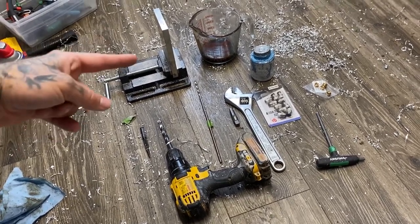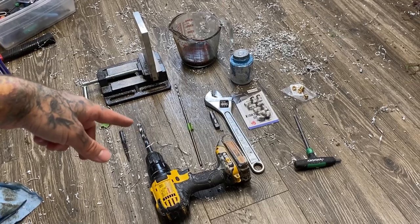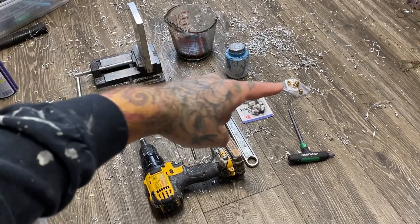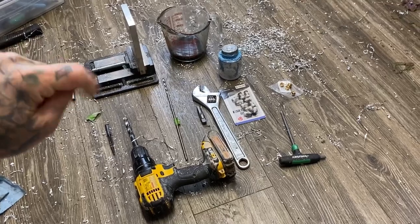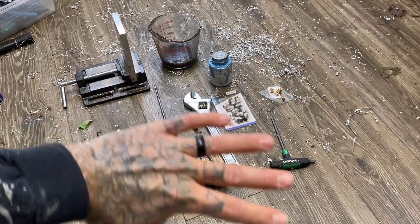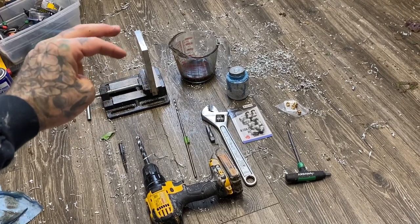The stock I wound up paying twenty dollars a plate — I spent about $180 plus tax. You're going to have to order a drill bit and a tap that fits whatever caps you get and whatever push-to-connect fittings you need. Make sure to get the same diameter and same thread. You can go on Amazon and get the tap, the push-to-connect fittings, and the caps — just get them all the same dimensions. For each plate, you're going to need one cap and two push-to-connect fittings.